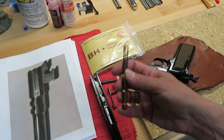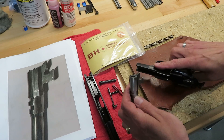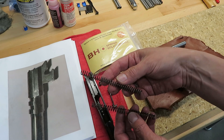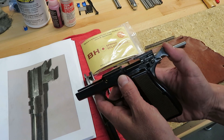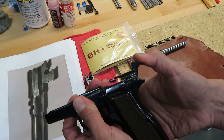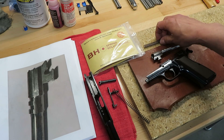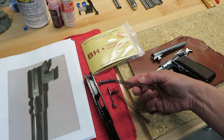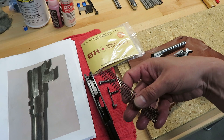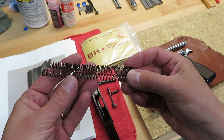That's really getting excessive. What we mean by excessive is the speed of the slide coming rearward is overcoming too quickly the resistance of the recoil spring — and the slide is also in the act of cocking the hammer against the force of the main spring or the hammer spring. We consider 12 feet to be right on the edge of where you start unlocking the barrel before the bullet has left the end of the barrel. When a spring starts to degrade and lose its resistance, one of the classic ways it shows this is decreased relaxed dimensional length.